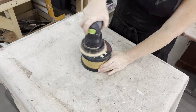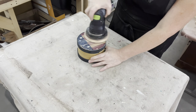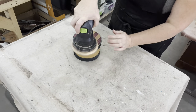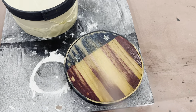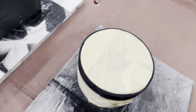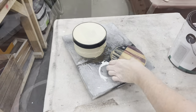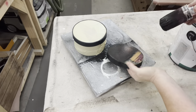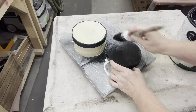If you notice, one thing about the auction hall was that there was a lot of Americana decor in there. So a lot of the pieces that I've been making over today are some of the Americana that I didn't really think would resell for me. So I'm going to be making them over, including this little box. I sanded it nice and smooth, tried to get all the paint that I could off of it, and then really taped it off because I want to leave that natural. But I'm not sure what paint was used, and a lot of times red will bleed through. So I pre-conditioned the wood using the shellac spray, a couple coats to even it out. And now I'm going over the top and the bottom — which looks black but it was blue — with some black paint.